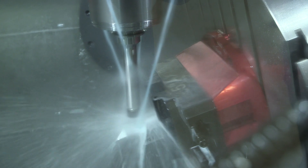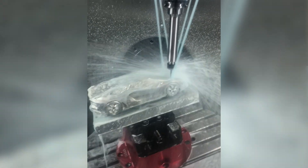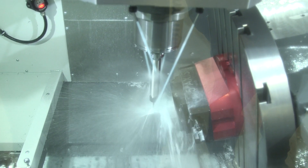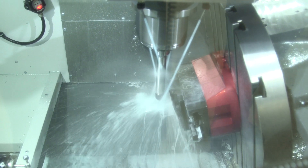We are blown away already — it's a huge difference from what we had before. We bought the upgraded spindle: a 15k spindle on this machine versus our other 10k and 12k spindles. The 15k will allow us to run parts harder and faster and keep our chip load consistent, which directly affects the life of our tools.